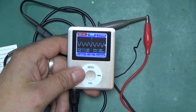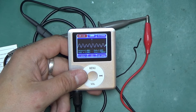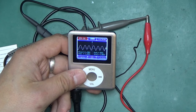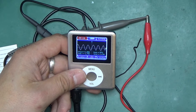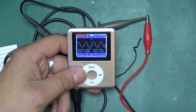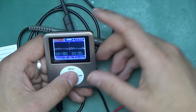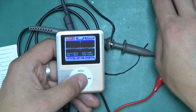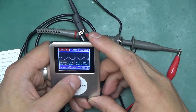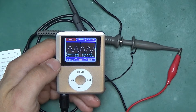At 7, 8 megahertz you can barely make out what this waveform is. At 10MHz, bandwidth is typically defined as where the signal drops to 0.7 of the original. We're at about 6MHz right now for usable bandwidth. At 20MHz we're seeing about 50 millivolts — a 20MHz sine wave fed into this gives not so much. So about 4 to 5 megahertz is where it actually deals with the signal quite nicely.